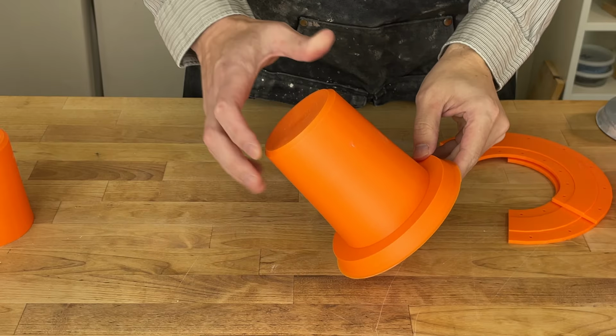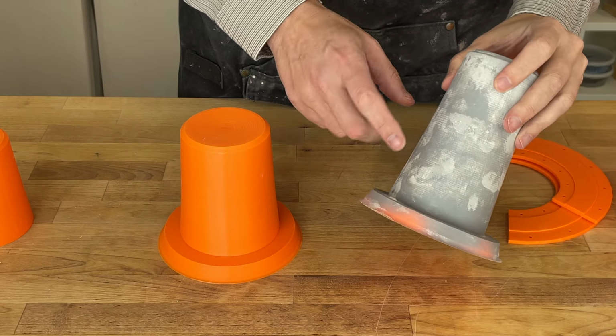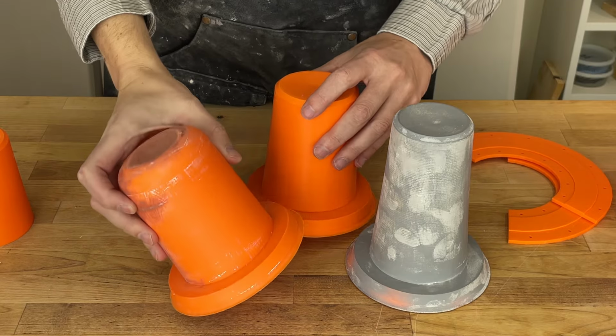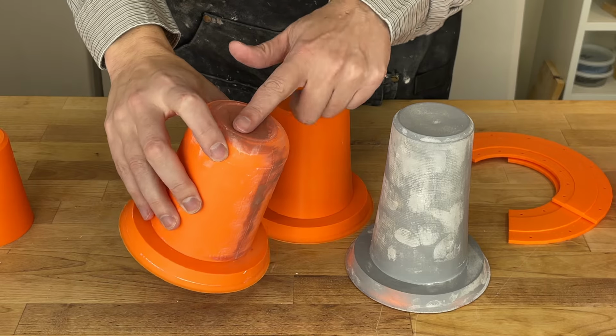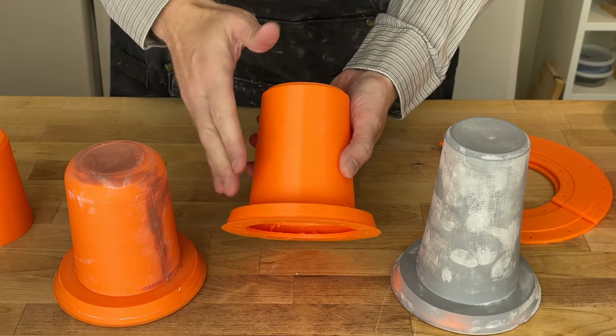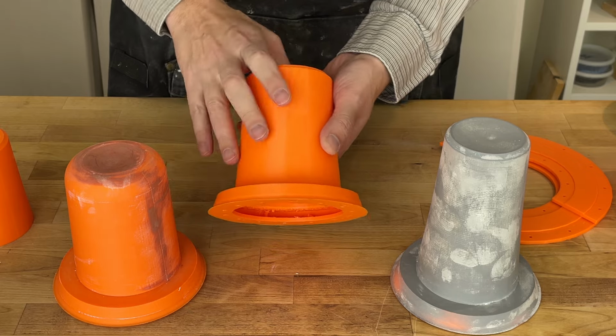Next up is to go ahead and clean up our inner mold a little bit. Basically I want to do something similar to this. This has some plaster residue on it, but underneath the gray is actually a primer. And this one here is a different mold, and this one I used some spot putty on. I think I'll go ahead and try the spot putty and see how it works, because overall the prints are really good. There's a lot of comments on my channel about layer lines in the prints, and when you print on the fine settings, they basically disappear. So you can spend as much time or as little time as you want, especially by the time you go through the whole process of creating the pot and it shrinks and you're using a sponge to wipe things down. The 3D printed artifacts basically go away.